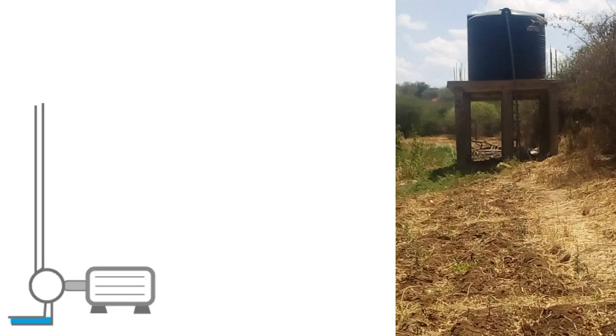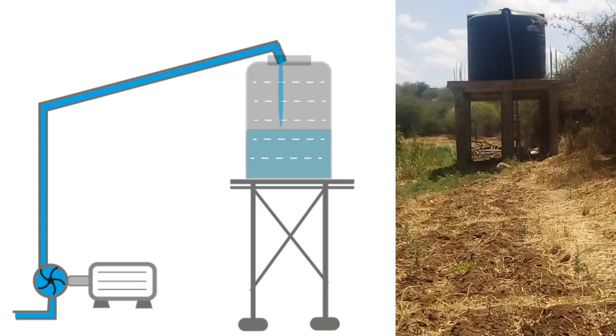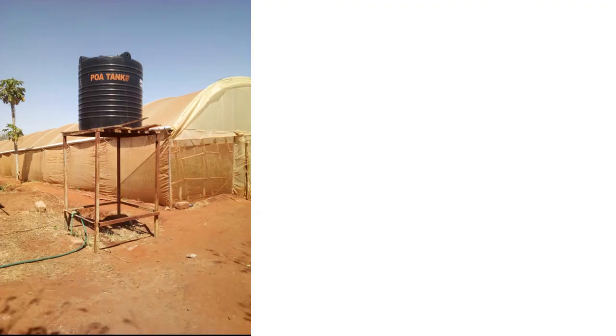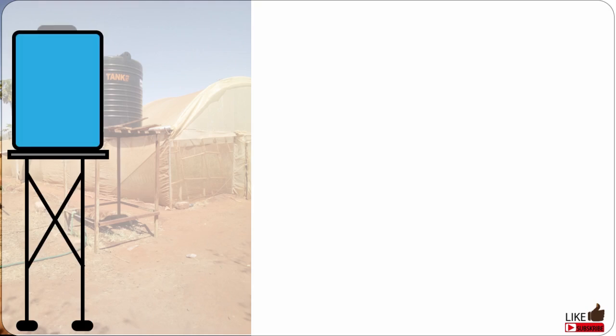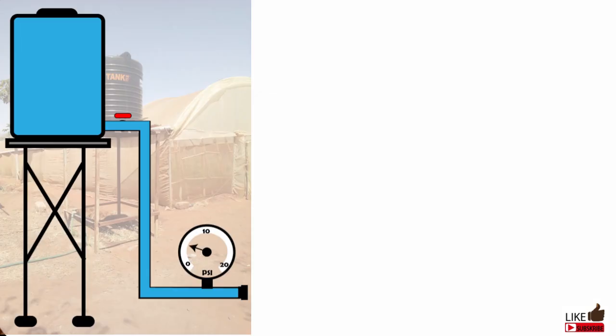In that video I mentioned the two common ways that a Kenyan farmer can create the necessary pressure used for irrigation: either using a pump to provide the pressure energy to force the water into the main line, or using an elevated storage tank and then later using the water which now has potential energy or pressure for irrigation. In that video I talked about pressure at the lowest point on the main line — that was the static pressure, the pressure on the pipe with the water not flowing.